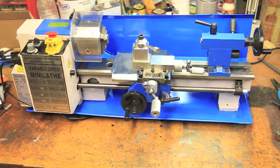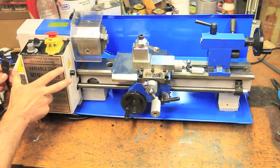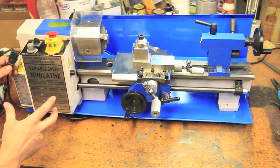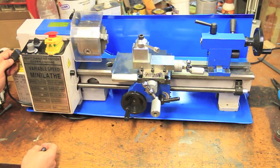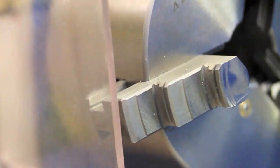One of the major things that I changed in this process was how the wiring was done. The control box, lathe frame, motor, safety cover, and rear cover were previously all connected by wires that were just long enough when everything is assembled. This led to frustrations when having to remove specific pieces for any reason. Most simply, I added some quick disconnects to the safety cover and did so in such a way that it could easily be bypassed if needed, as the jaws will contact the cover when turning something with a wider diameter.